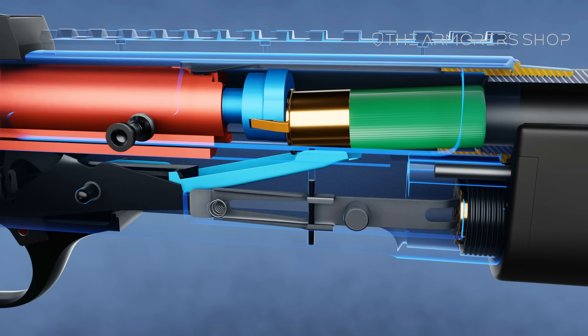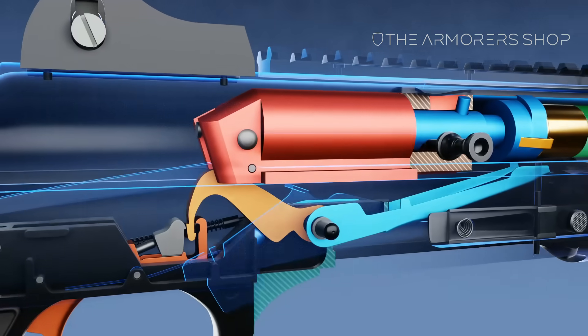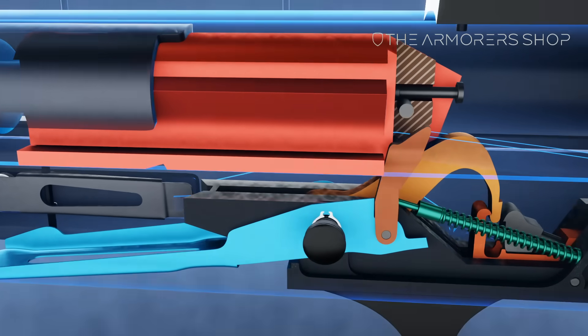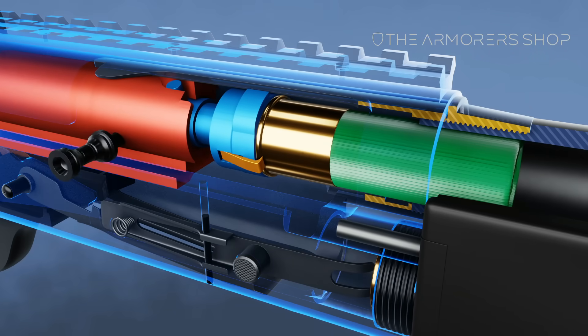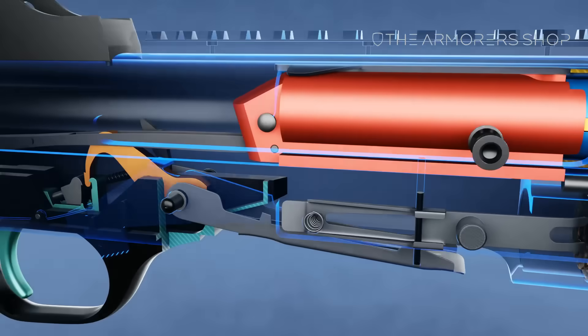The back of the round slides up the breech face and the rim slides behind the extractor. The hammer seats on the sear as the back edge of the bolt carrier moves forward. Pressure from the carrier spring on the breech bolt latch causes the carrier to drop down. The bolt carrier continues forward, contacts the back edge of the barrel extension, and stops. The cam pin in the bolt rotates the bolt into the barrel extension, locking it.